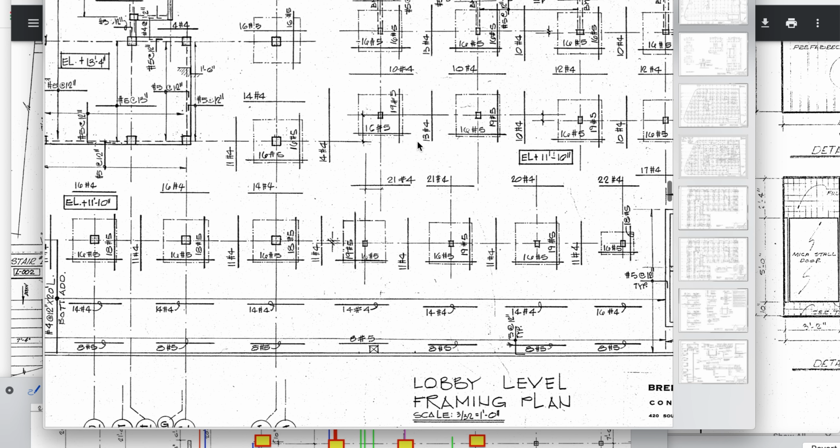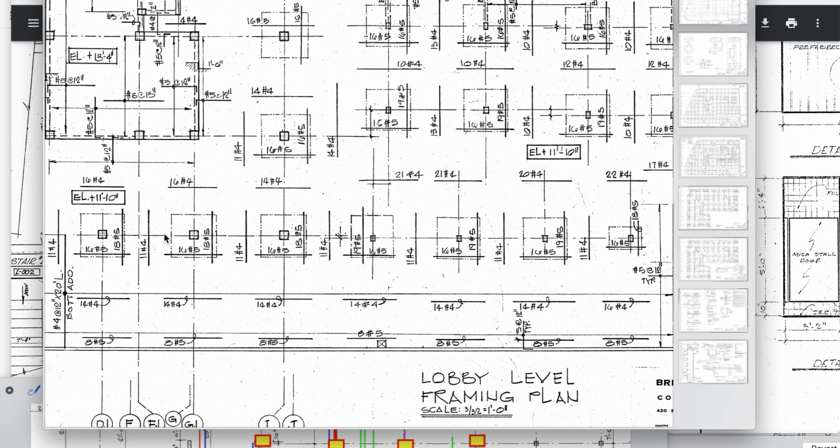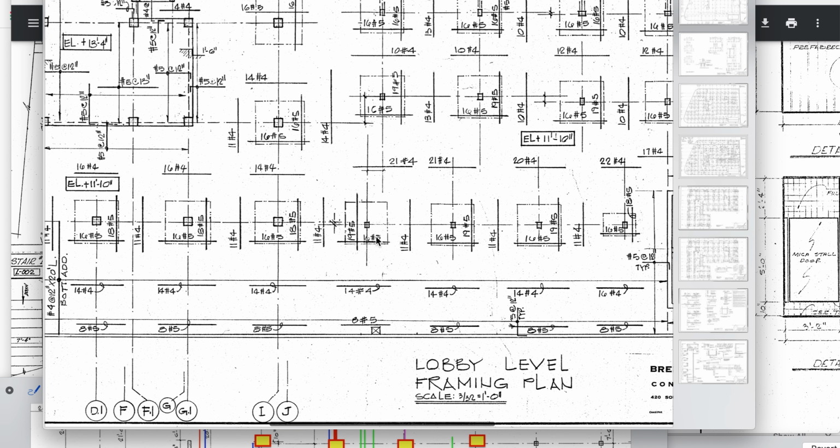So coming back to this. We have this steel coming this direction. It staggers and shifts. The steel is acting like a transfer beam, if you can think of it that way, because even though they're saying it's a two-way slab, it's two-way in cockamamie diagonal steel. So diagonally loading, when you're coming into here, I'm loading not just here, but I'm loading out to here, and then I'm loading on a diagonal. If I load my vehicle here, it's clearly not a cantilever. So I'm then transferring my load over to here, but how am I getting there?